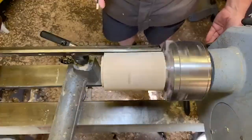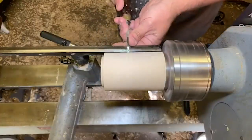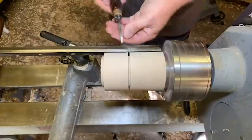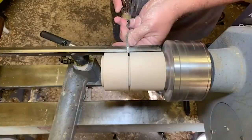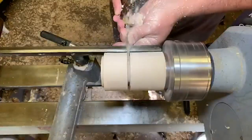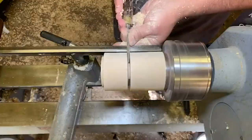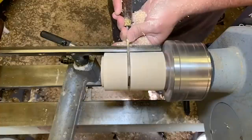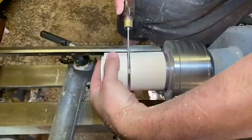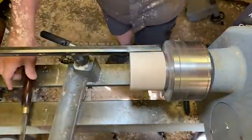And I'm going to turn the lathe speed to zero, turn the lathe on. And I'm going to start off by making a cut. Now, when you're parting off to any depth, it's quite important that you don't make a single cut. You make around about a cut and a half, just to give the tool plenty of room, and keep overtaking your initial cut, just so there's no grabbing and binding up. Here we go. So I'll just make sure I grab that one. There we are, it just stops in the hand. That can be put to one side for the moment.